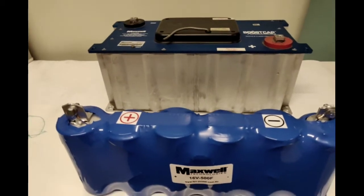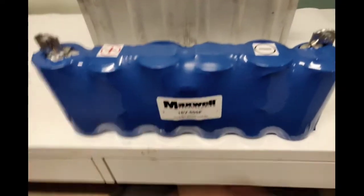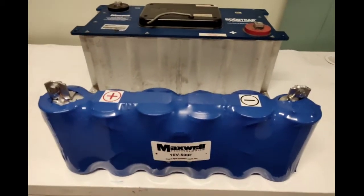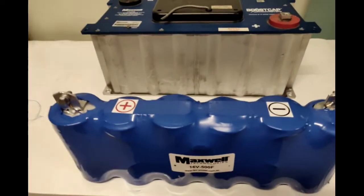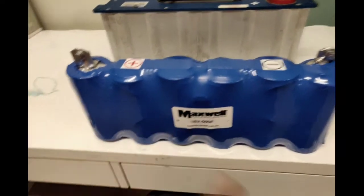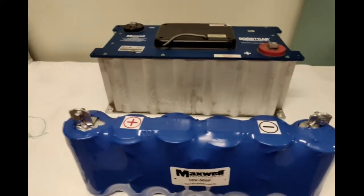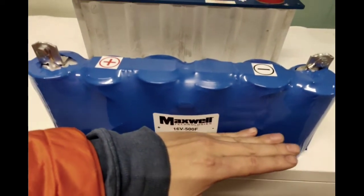If you need a 24 volt system, you need two of the 16 volt units to make 32 volts, so you can run a 24 volt system charging up to about 28 or 29 volts. Compare that to just buying the original 48 volt for $300 — same price as two 16 volt units at $150 each. If you're running a 24 volt system with a 48 volt supercap, you are way off for maximum performance. Two 16 volt units give you 32 volts maximum, and you charge to 28–29 volts, so you're only four volts off from full, versus 48 volts where the capacitor is nowhere near full.